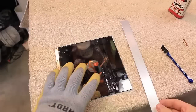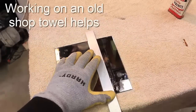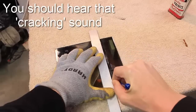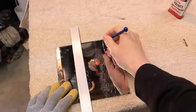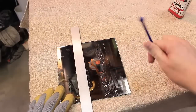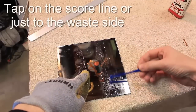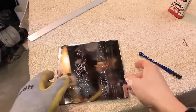Here's how to do the cut. I've already put some oil where I'm going to make the cut, and I oiled the cutter too. You tightly hold it on the line, press firmly, and make the cut. Then check if it's scored all the way through — if you miss a spot, go back and make sure you get the whole length. Next, flip it over. I'm going to tap on the other side pretty close to the line to tell it where it wants to cut. Then we're going to snap it.